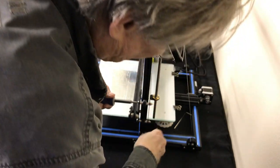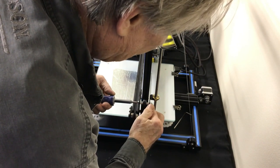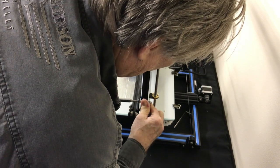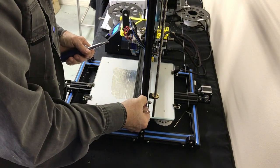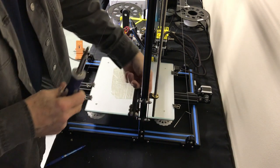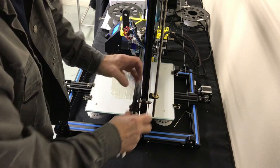Okay, I'm going to grab a hold of the back side of this bracket, and I'm going to take this wheel in this hand. Those fingers, sort of like eating with chopsticks, are going to hold this nut in place, and I'm going to screw in righty-tighty with my left hand while I push in on this right here. So that is going to put pressure on this wheel, and that wheel does not turn, or only very, very slightly. This is perfect serviceable limits on this wheel and this wheel right here. This is tight, that's tight, and the opposite one is tight. We have all three of these wheels in tension right now using this bracket. That has steadied this whole thing.